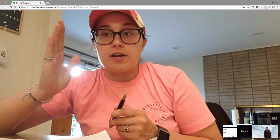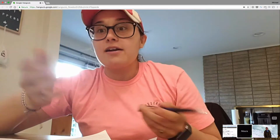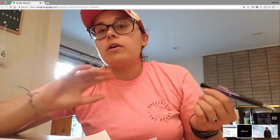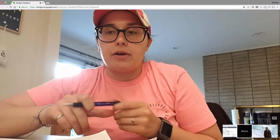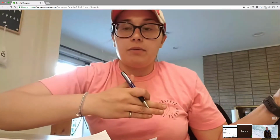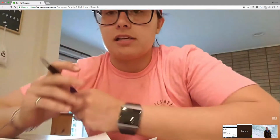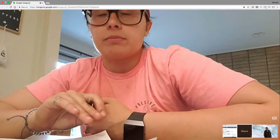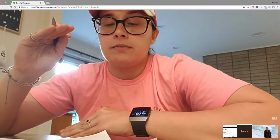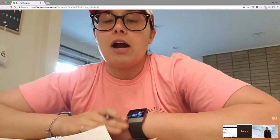Having a kingpin angle straight up and down is easier to design because you don't have any fancy geometry. So those are all things to take into consideration with your uprights, but it's doable as a first-year team to design them on your own and get them milled, or you could go the Polaris option, although it will give you some constraints in suspension design because that's a set A to B point for your outboard points.